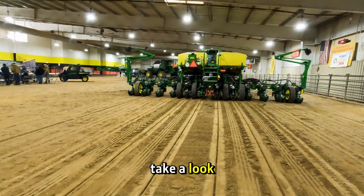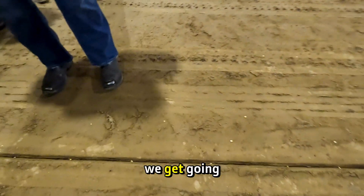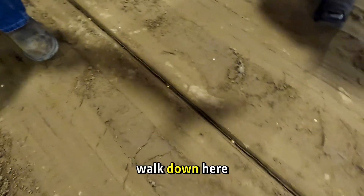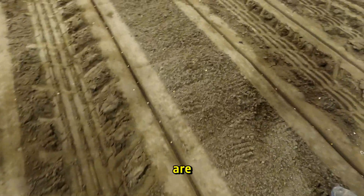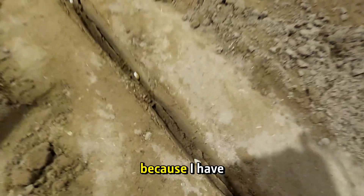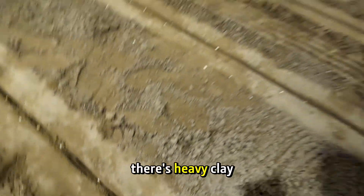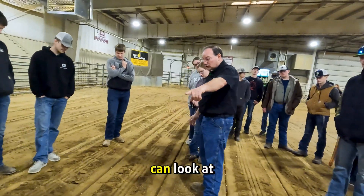Come on up here and take a look. You'll notice here we have kernels right away as we get going, but here we do not. The reason is I did not have him turn those meters, so there was no seed in it. That's when I made the comment earlier about filling the meters, so there's no seed here. Now as we walk down here about another 25-30 feet you can see here where the kernels are. It's not a really pretty trench because I have my depth set real shallow — there's heavy clay under here at about one and a quarter inches so I'm really shallow, but just enough that we can look at the seed.